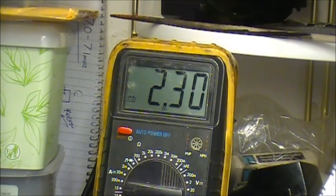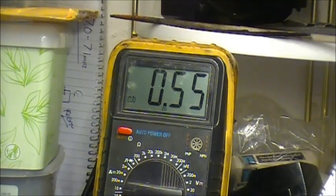Other than, yeah, we have an amperage problem. The radio shouldn't be drawing 2.3 amps on transmit. It just shouldn't be doing that. So there we go. I have the radio running on external power, and that's running into my Pyramid PS12KX power supply. It's a 10 amp, 12 amp surge power supply. And she's drawing 2.3 amps from the power supply on transmit.